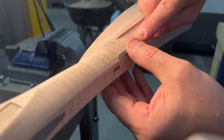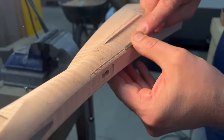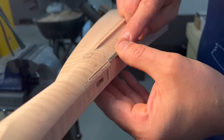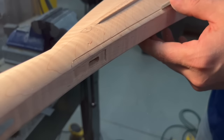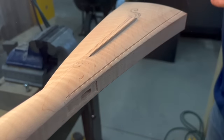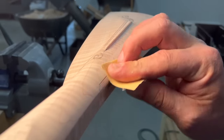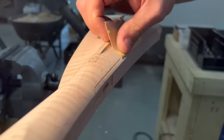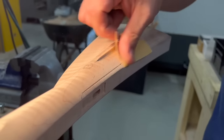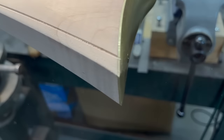There's a little bit of a mistake there. If I made that mistake and wasn't making a raised line — this background is going to get relieved anyway — but if I was just making an incise line, I would sand that down to clean it up. If you have a little area you're sanding, don't just sand that one particular area or you'll create a hole. Use a little 220, then probably 320. Now we're going to terminate this line with a little curve down. Curves I always have better luck with tapping.